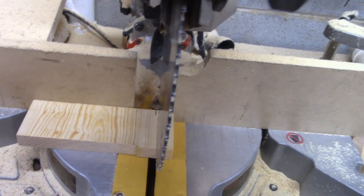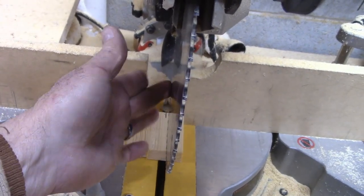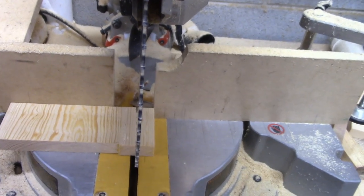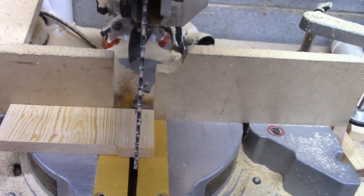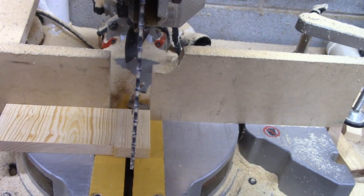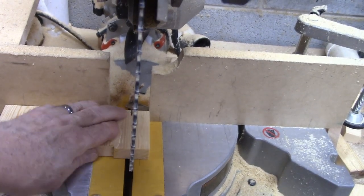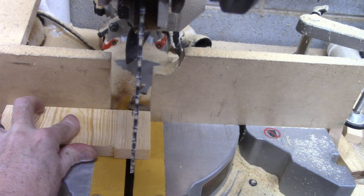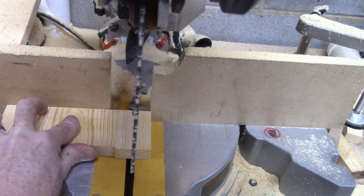And if you're looking off to the side you can see the front and the back. So move your eye until that back edge just disappears like that. Then you're going to look down and move your material in until it just hits the line of the blade like that.